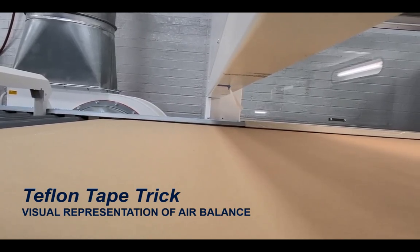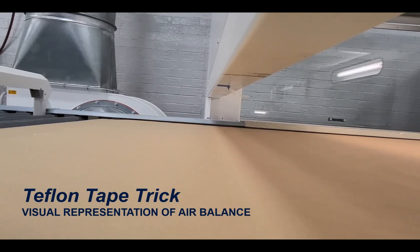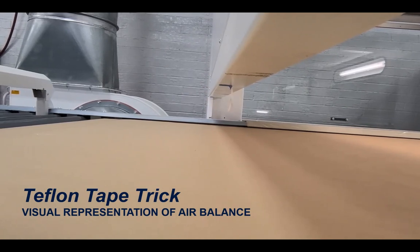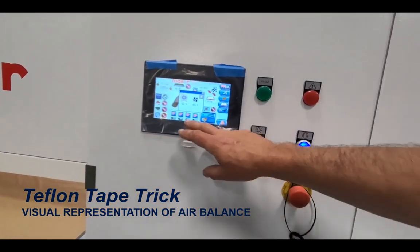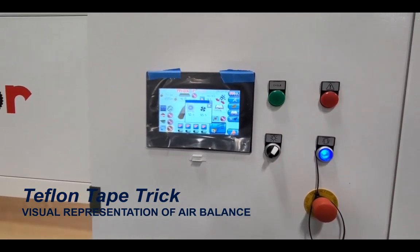The opposite situation where we have too much draw from our filters, exhaust side, and not enough on the intake side is what you see here. This would be a negative booth. This would draw in dust and extra air across your part as you're spraying and can cause spray issues as well. So we want to avoid that. We want to try to stay in a neutral state like you see here. So it's slightly negative. Here you see on our display screen the ability to do the settings for the exhaust fan and the intake fan. It's variable in 5% increments.